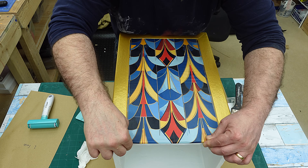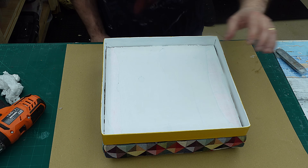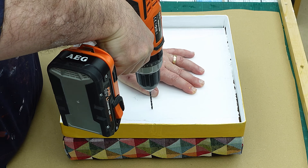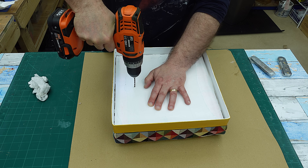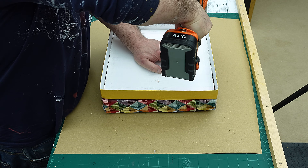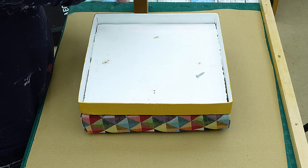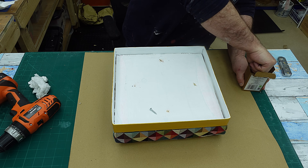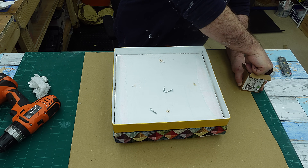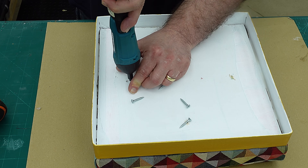Nearly finished now — it's going in my living room. What I need to do now, while that's drying, is attach this to the actual upholstered bit. I'm going to drill some holes to start with — it's fairly easy to know when you've gone through — and then I'm going to screw this into the wooden piece that I used to upholster it with. That way it's not going to go anywhere. I've made sure that these screws aren't too long, so when you sit on it they're not going to stick in your bum.